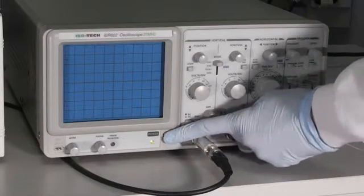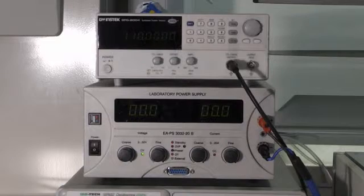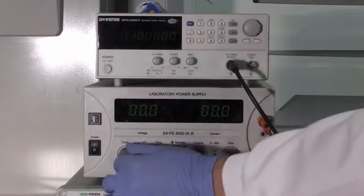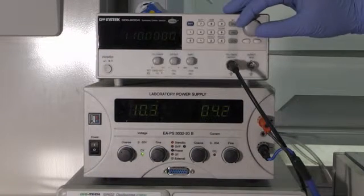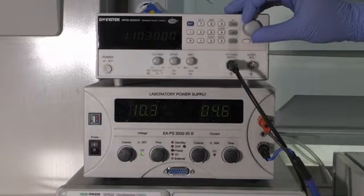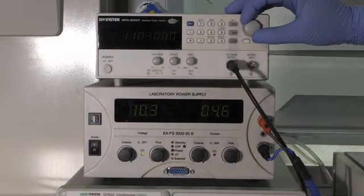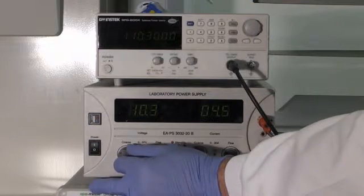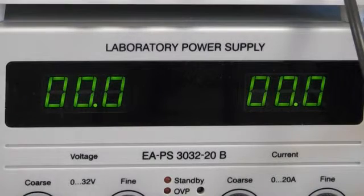Take 1/3 of the voltage input for 110 kHz from the matrix sheet, 10 volts. Now slowly increase the voltage to 10 volts and you will observe a peak-to-peak voltage increase in the oscilloscope signal. Now tune the circuit to its resonant frequency, the frequency at which the amplitude is high within the LC circuit. When this tuning is done, lower the voltage back to 0.